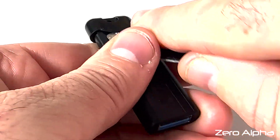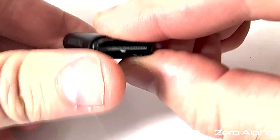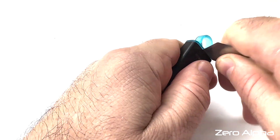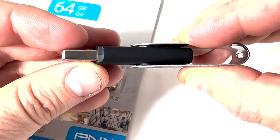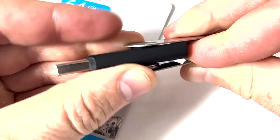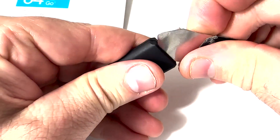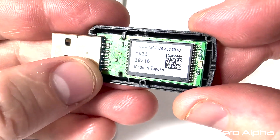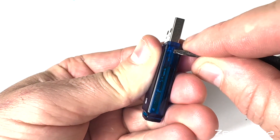To open this style of USB stick, you need to pop the end off — get under there, pop the back off. Push that out and the USB will slide through. To open one of these Kingstons, get in the back, push down, get under a little bit and it pops out. Next is the PNY — same swivel action, feels reasonably good quality. Just pop them off these little axis points. Get a nice flat pry tool, get in there, and start popping around the joints. There's our little memory chip. With these Emtek ones, we need to get a little screwdriver into the side and pry it out.